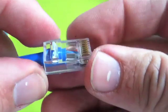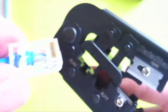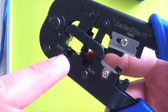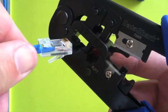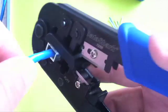So that's pretty well done. Now grab your crimping tool. This is an RJ45 connector, so that's the hole you're going to be using — RJ45 as opposed to RJ11. The locking piece goes down. You just push it right into there until it stops, and then crimp it.